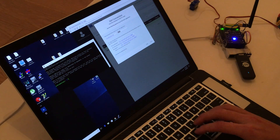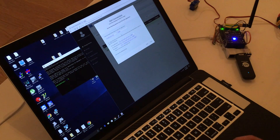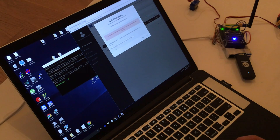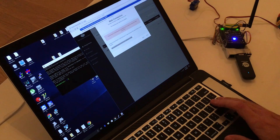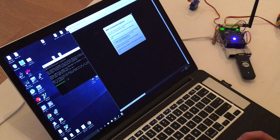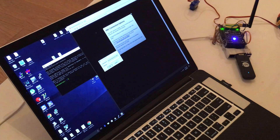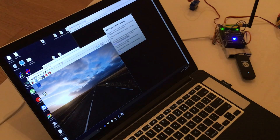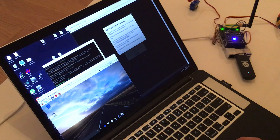To prove that further, I'm going to start TightVNC and request a VNC login for my Pi from the website under VNC. I press it, press confirm, and it gives me a link — proxy50wave.com. I copy that and paste it here, enter 'raspberry' as the password, and now we have a virtual desktop of the Raspberry Pi. You can see Wi-Fi is off, so we are indeed logged in by SSH and VNC over a 4G connection.